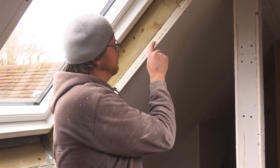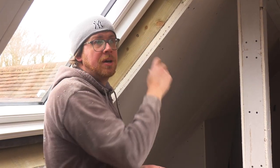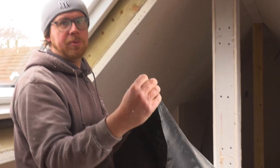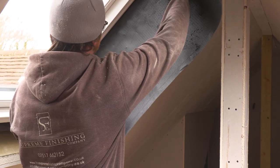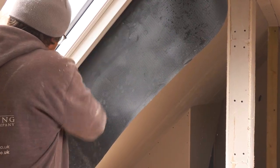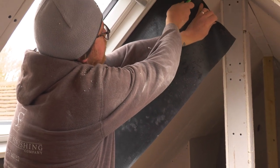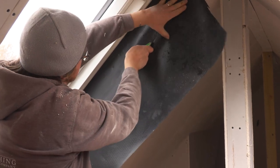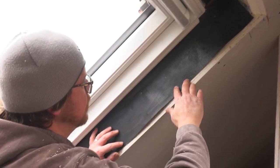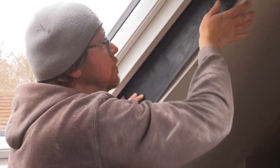Within the regulations of putting this loft conversion in, we've put this board up and because it's thermal board — closed-cell thermal board — it acts as a vapour barrier so no moisture can get into the timber. But now we've got four holes in the roof which have no barrier. So we put a bit of DPM/DPC on the side and all around on every side — just a couple of staples to hold it in position — and we can cut it off. We don't have to come right to the front edge because we're already crossing the vapour barrier there. We get that across the top, the other side, and down the bottom, and then we're ready to put our board in, which fits up into the little groove on the windows and back to our trimmers and rafters.